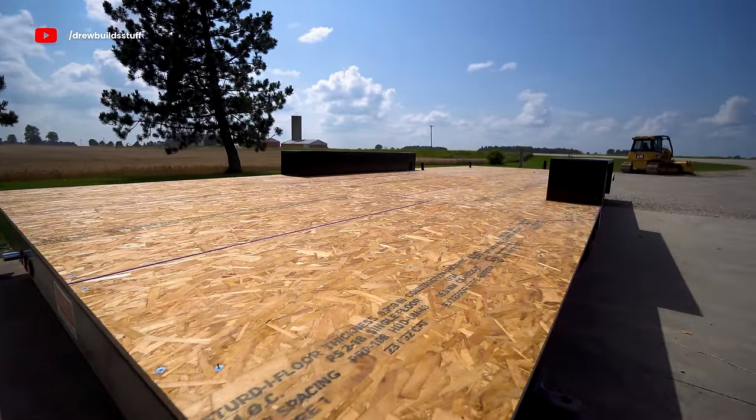Another tip, after I put up the first few pieces, I noticed that the overhang wasn't actually the exact same for every single rafter, so I actually started cutting them about 1 inch long. And then I'd just tack the rafters up with one screw, and then I'd just use a 2x4, since my preferred overhang is 3.5 inches, to mark the cut line. Then I'd just take them down, cut them, and then put them up permanently, and then they all have the exact same overhang.